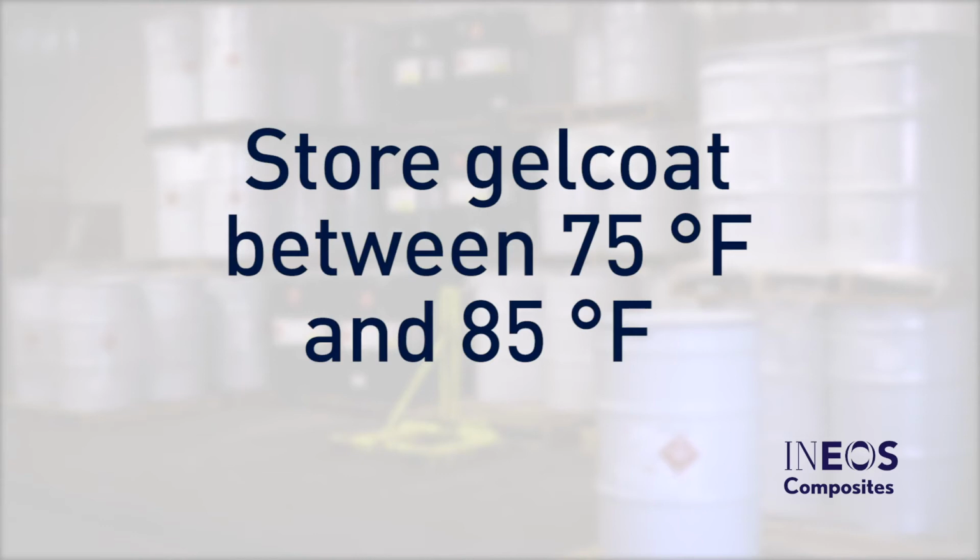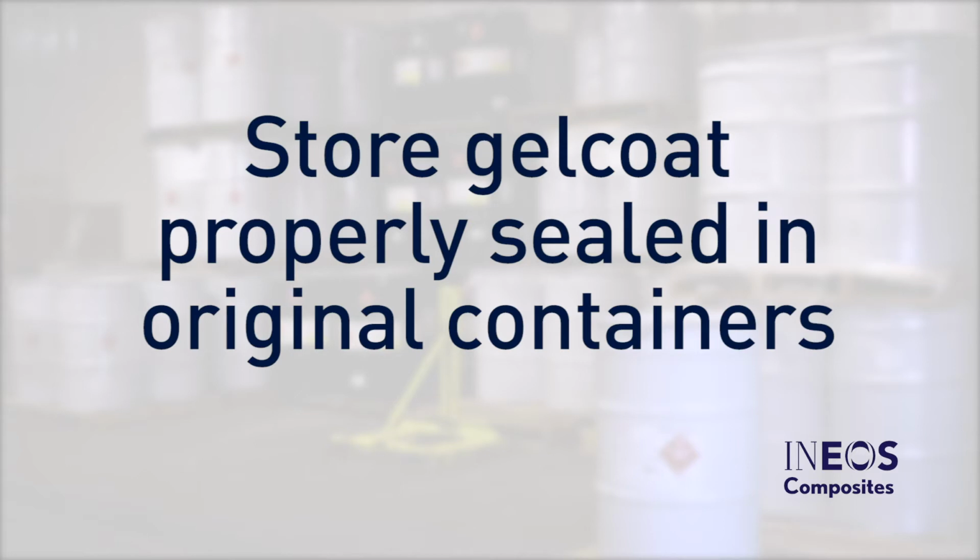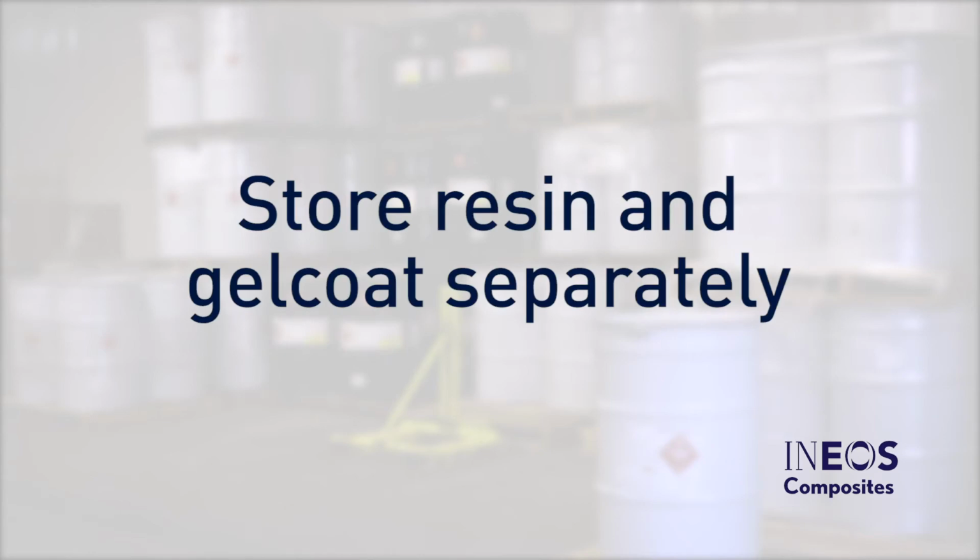Gel coat should be stored between 75 and 85 degrees Fahrenheit. Do not store gel coat in direct sunlight, as it can cause the material to degrade faster due to excessive heat. Make sure all packaged materials are stored in their original containers with lids and caps tightly closed. Store resin and gel coat in separate areas for ease of inventory management.